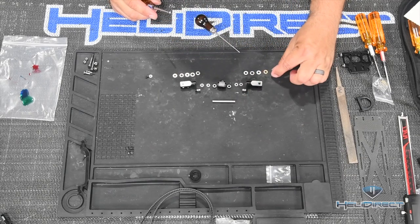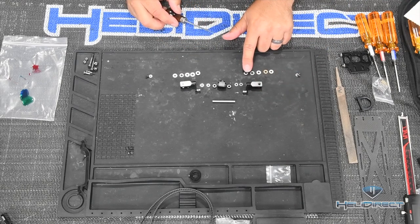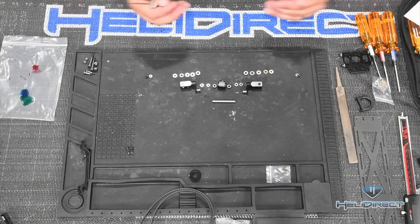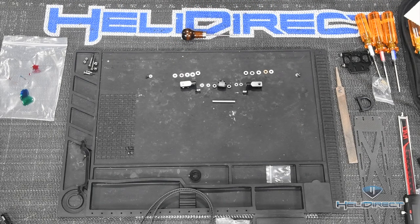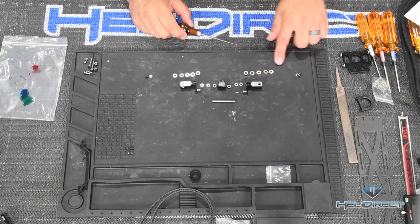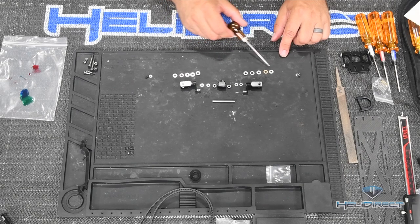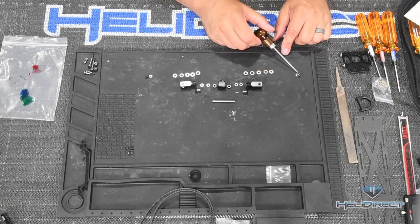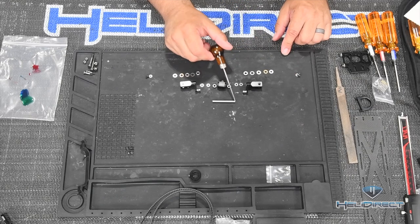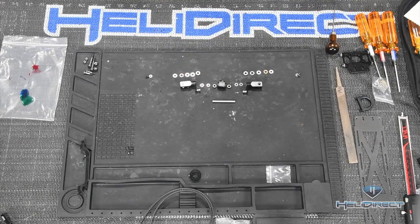So that has been pre-installed at the factory with some bearing retainer. We will not use a bearing retainer on this other bearing because the compression of the tail rotor will mean that bearing can't go anywhere, so there's no need. And all of these, this is one of our bearings, washer, and then these three make up what we call a thrust bearing or thrust stack, and then they will be captured with this bolt and washer into the ends of this feathering shaft. So we're going to take this on step by step. It works exactly like the main rotor head, honestly, so fairly simple.